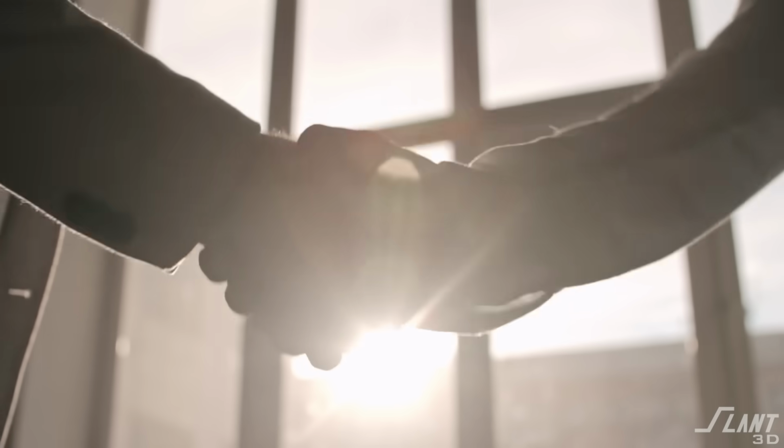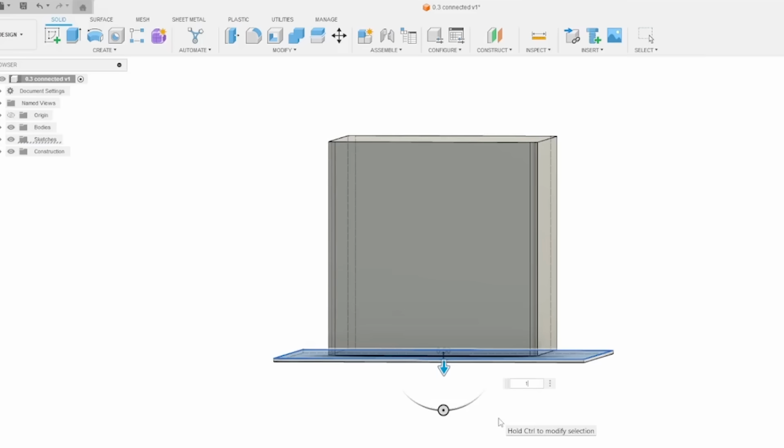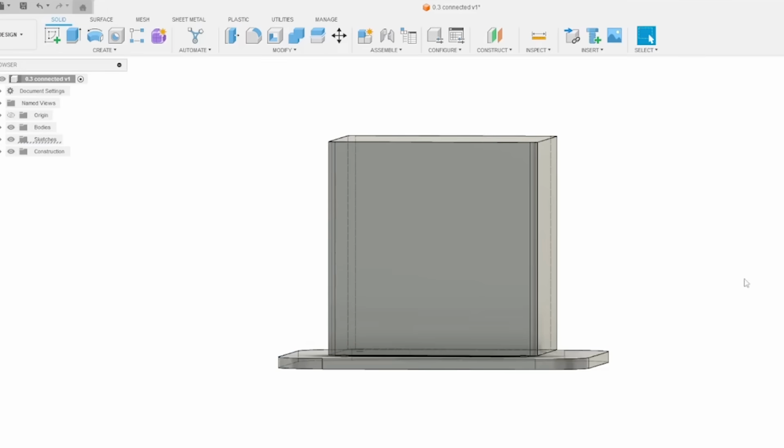Now, very lastly though, there is one more thing that we can do with the print itself to make sure it's stuck to the raft. And this is an advanced feature that requires a lot of teamwork between supplier and designer. And what you can do is now thicken the raft so that it's very thick and rigid, which can be useful because, again, if a raft is thick, it's more difficult for it to warp if you're using the correct type of materials. It can effectively have infill, and now you have a strut underneath the part.